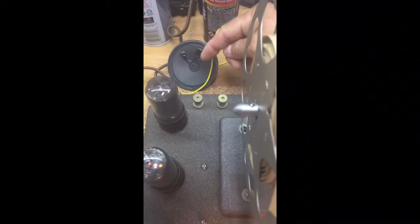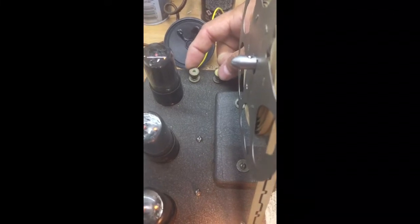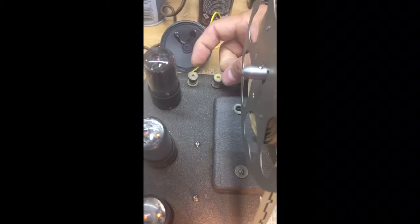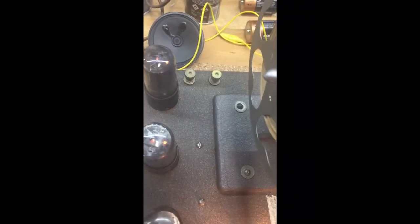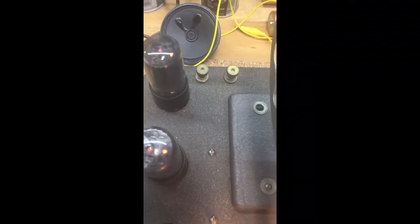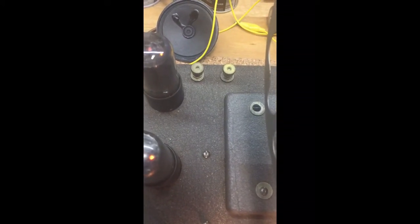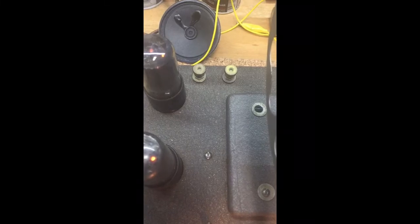And sure enough, I hooked up a meter to these terminals, and they not only have an audio tone on them, and I played it with the speaker. It's not very loud, but it's for headphones. But it also produces from 0 to about 0.5 volts AC, so enough to drive a small lamp. And probably it's AC, not DC. So I'll experiment with that a little bit, maybe put a diode LED there, and see if I can get it to actually blink an LED.